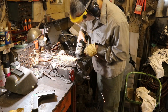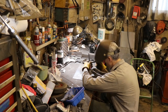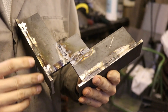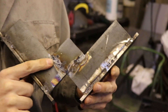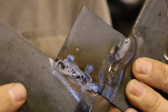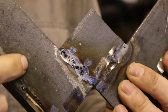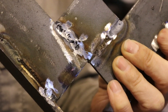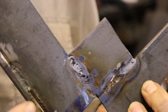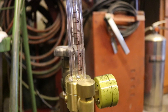Here's our semi-completed, mocked-up angle jig. When I went to weld it I had a whole lot of porosity — you can see how porous it looks, like bugs have been eating it. This is quarter-inch material and the first time I've welded anything this thick. I should have done a test weld first. I think I can remedy this by increasing the gas flow — my flow rate was around 10 or 12, and I'm going to increase it to 15 or 20.